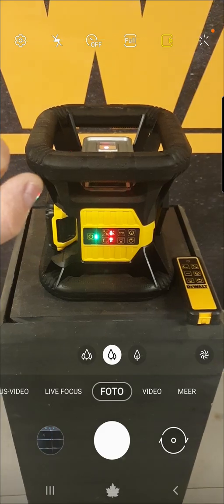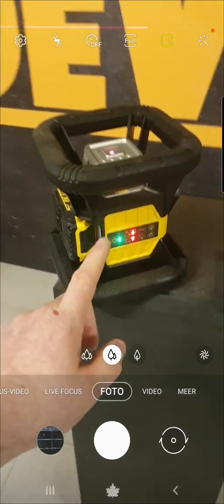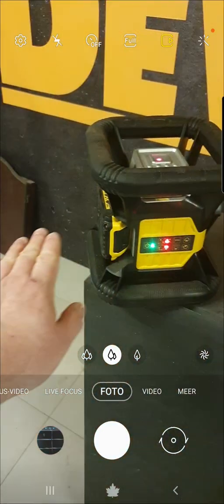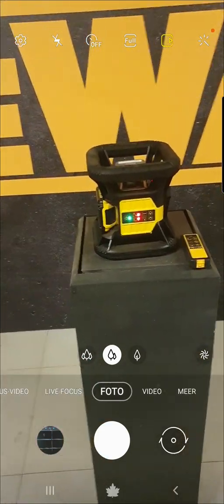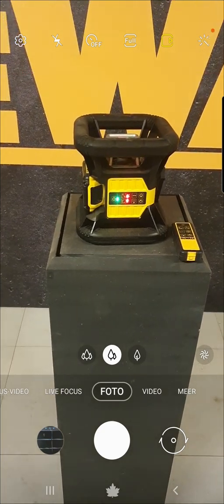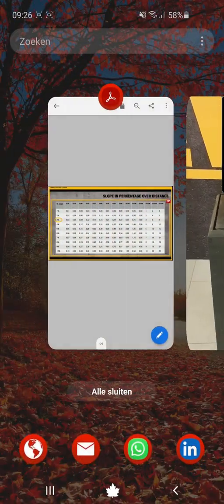Working outside and making a square flooring — my camera always shuts down, I don't know why. So what do I do? I move my rotary and put it on the corner. Right now I have a double slope: one manually and one digital with the setting of the rotary. The line is going to this corner — it's about how you position your rotary. Why is this not useful for inside? You cannot put your rotary in the corner easily for ceilings or whatever you want to do with double slope inside. But it's a trick if you're using a 74 from DeWalt.